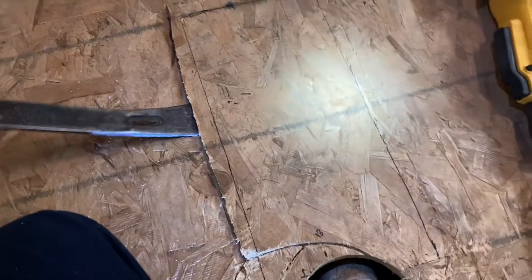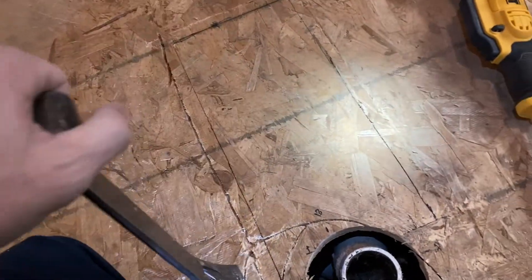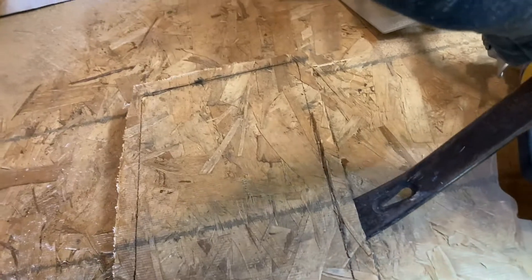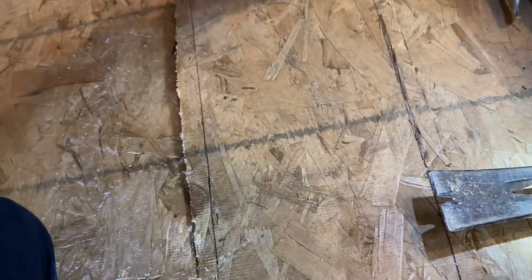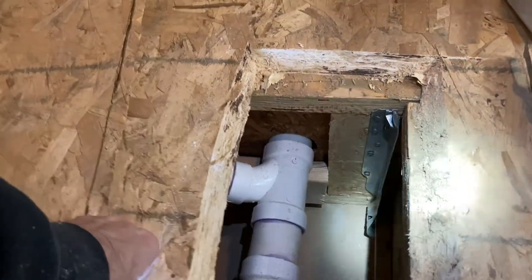I can see the cut line and confirm I didn't go deeper than intended — my joists are still fully intact, and you can see the cut is at a 45-degree angle. With the cut complete, I'll take a pry bar and pry up that subfloor. Be gentle because you want to put this back securely. I figured I needed to cut up about this much to access and reach the PVC pipe underneath — you might need more or less.